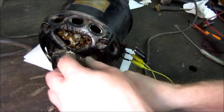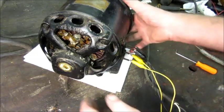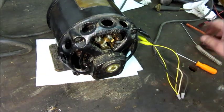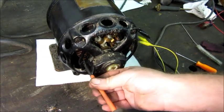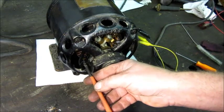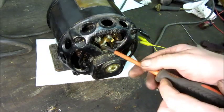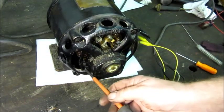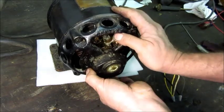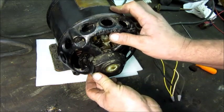It does more than hum now, so I think I can take this tag off of there — it's earned having the tag removed. Now there's some other stuff that can make it hum but not start. This screw on the slider part right here is what sets the rotation direction. There should be a little notch right in the side here in the pointer. Loosening it lets me rotate the brush holder, though it's just really stiff. I can feel a notch there and a notch there — those are the rotation direction notches.